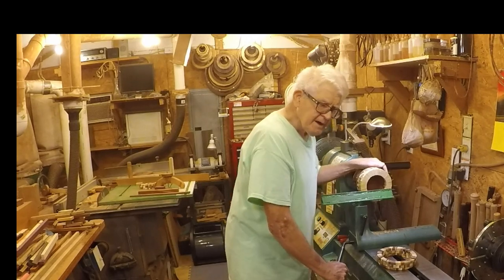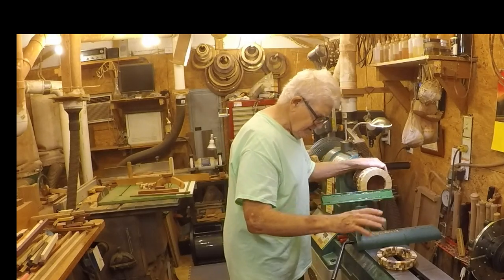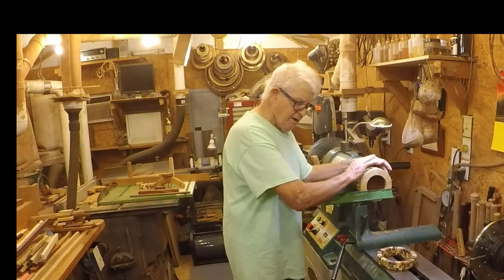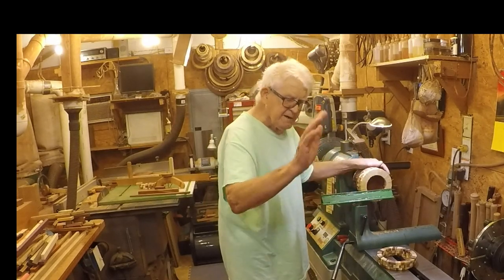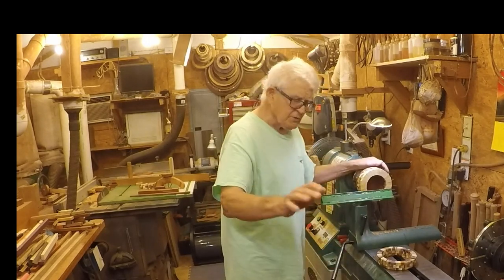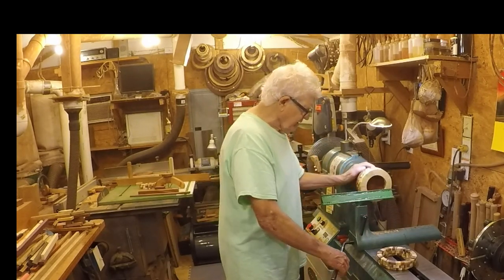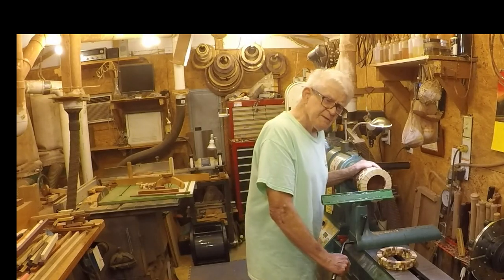And I've got a couple of videos on my channel, Earl Small Signature, just on sanding. I take a piece of really hard wood turning, really hard wood. I scratch it up with 80 grit and then I take it all the way to a piece of glass in just a matter of a couple of minutes. No power tools. They supply all the power you need. Very easy, very quick, and I show how to do it. Like I said, it's a hard wood I do it with.